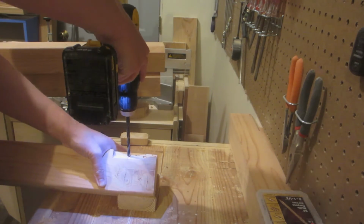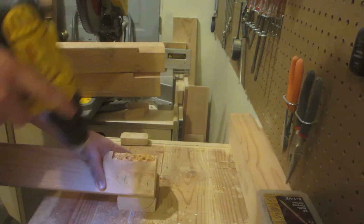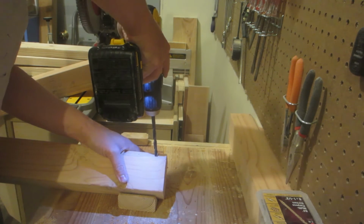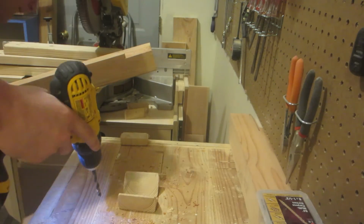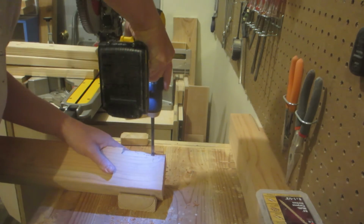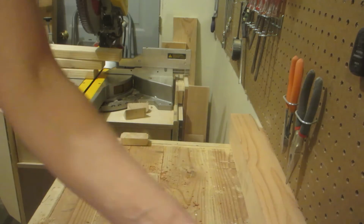Here we have the screw-ins of the 4x4s themselves. I used my table saw to get that 45-degree cut along the side, and just a 7/16 drill bit to get the holes that allow the wood anchors to fit right in. It seemed to help out a lot having the two diagonal pieces to sort of rest on, and I can get a good vertical drill into the board itself.